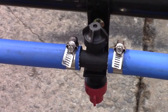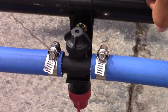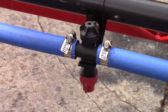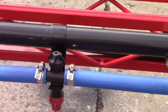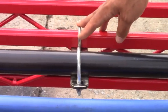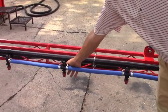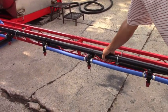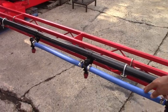This customer wanted to use AGCO nozzles because he has a self-propelled sprayer by them already, so he only wanted to stock one part. We came up with a solution: we made stainless steel brackets that bolt onto our existing tripod boom with stainless steel U-bolts, and these brackets are made by AGCO. He also wanted 800 PSI hose.